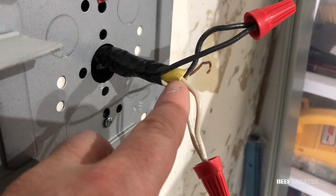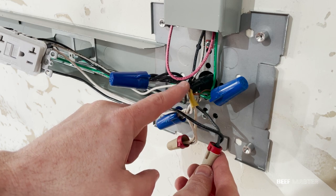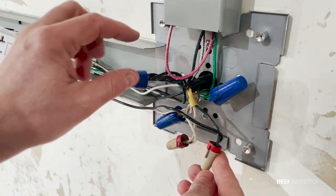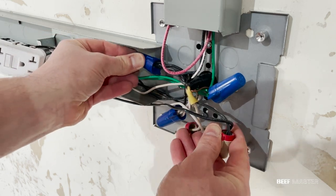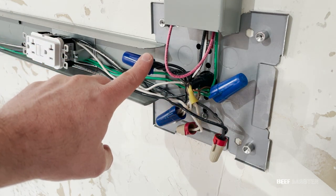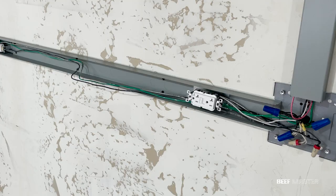The yellow encased wires are the home run which means they connect directly to the circuit breaker — this is what I'll connect to the GFCI plug. When it's all done it looks like a big mess but I'll try to go over the basics. I'm not a licensed electrician so I recommend hiring one to do this part. The home run line connects to the GFCI plug, and the hot line connects through the bottom half of the GFCI plug. The other black wire is the load and it connects to the other outlets. The downstream load from the GFCI plug is protected. The white neutral wire also runs through the GFCI plug first and connects together to the other outlets. The green are ground and are connected and capped off. The home run carries the line to the GFCI plug and the protected load is carried to the other outlets. The home run neutral also comes through the GFI to the other outlets and the green ground is capped off. You'll need a licensed electrician to inspect your work or to do it for you.